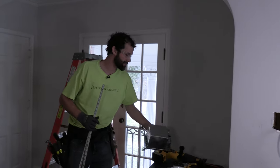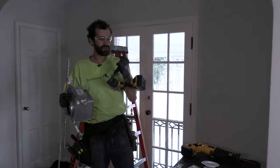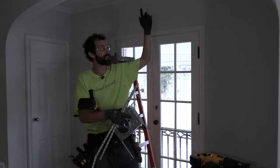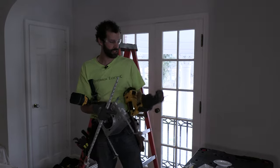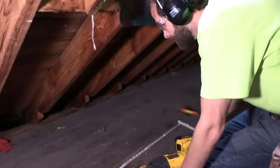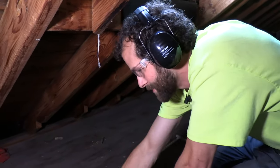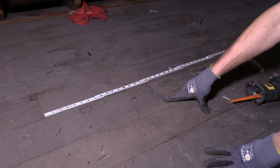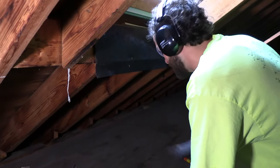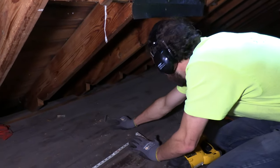I'm going to take my can light, drill, 12-2 wire, and other gear up to the attic to maximize trips. I've got floorboards to address — I'll try a hand tool first, and if it gets too hairy I'll pull out the circular saw. I'm trying to echolocate the framing. The flooring has not been face-nailed, so I can't see where my joists are, but I'm anticipating 16 inches on center. I need to figure out where the framing is before I hack this up.